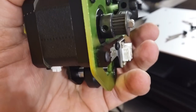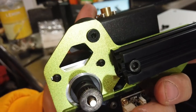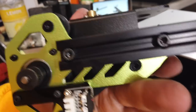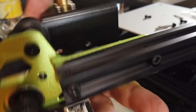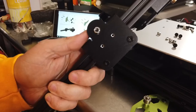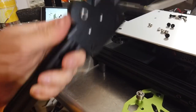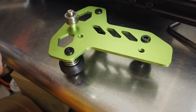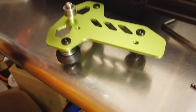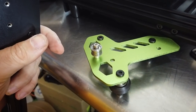The end stop switch is done — that's why the two bolts on the bottom are longer than the two on top. Stepper motor installed: basically slide it all the way on. The bushing for the lead screw goes there. The X-arm uses substantial bolts that go into inserts in the aluminum, so you're not stressing the aluminum. You can put them on tight — that X-arm is not going to move. The X-axis carriage is assembled, no issues. The Z-axis carriage rides vertically on this side, with the idler on the other side.